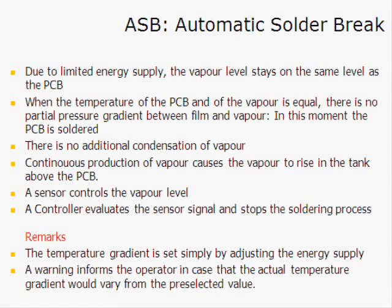This automatic solder brake is actually a safety feature that protects against a light-mass circuit inadvertently being reflowed under the profile most commonly used for a high-mass circuit. In essence, you cannot overcook the circuit — there are physical fail safes in the system that protect against the wrong profile being used for the wrong circuit type.